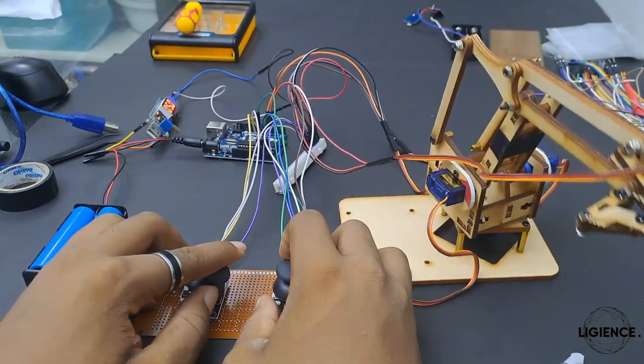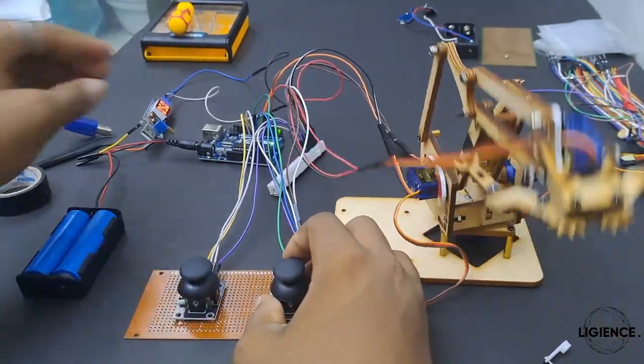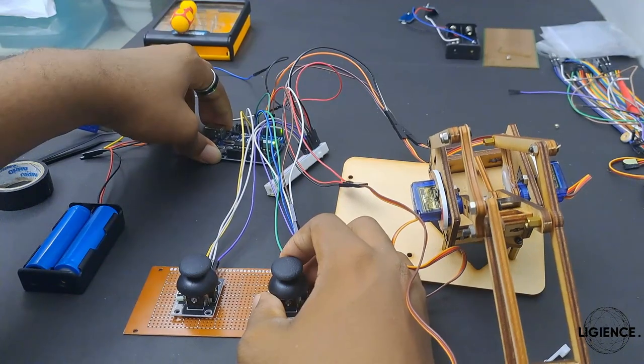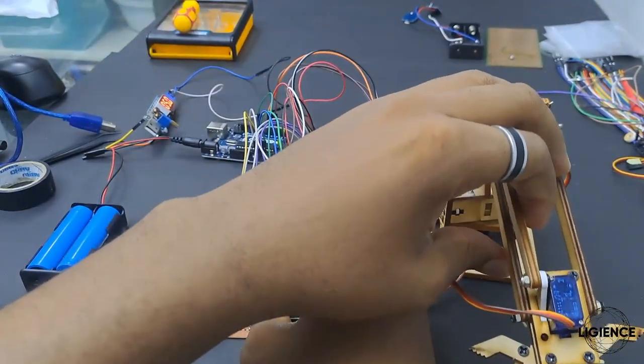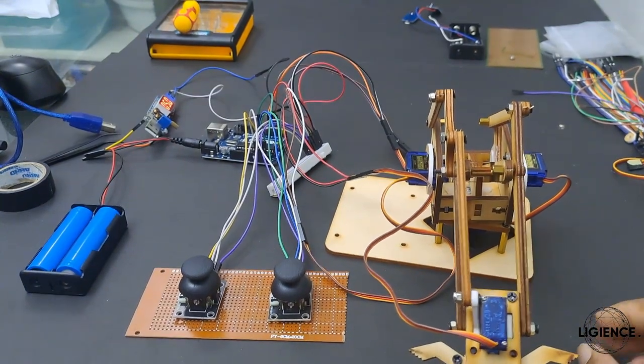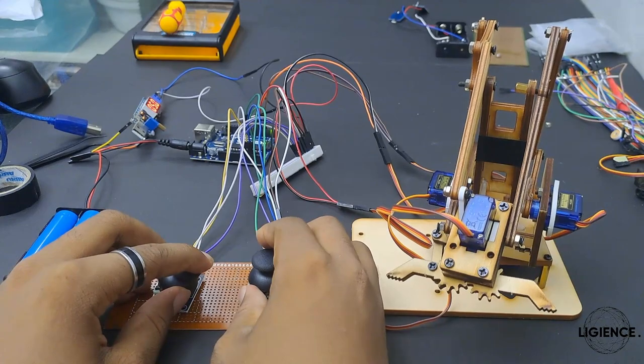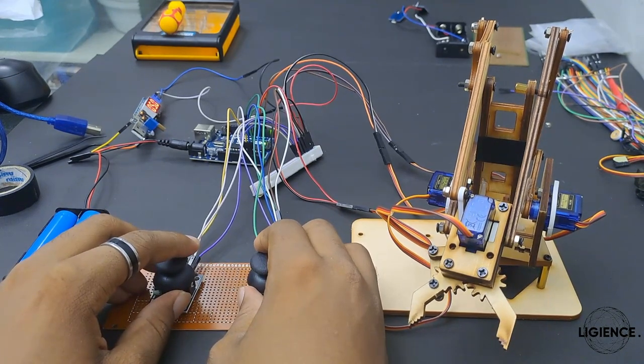Also, as you can see in some clips, because there isn't any clear min and max value for the arm, at times the servos overshoot the range of motion attempting to reach the position they're instructed to go to, but the frame doesn't allow it. This also applies to what I was explaining about the degrees of freedom and the lack or presence of constraints in the motion of the parts of the robot.